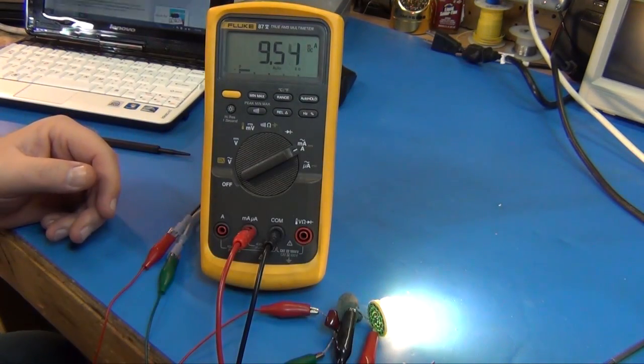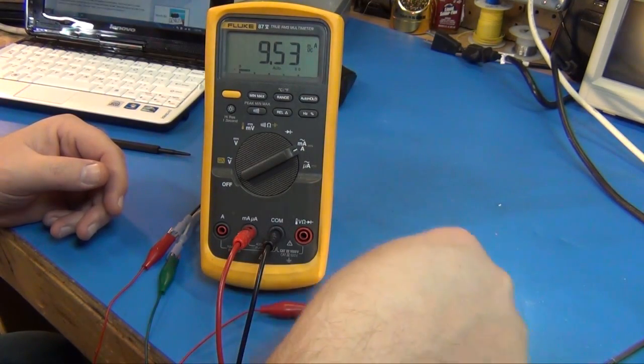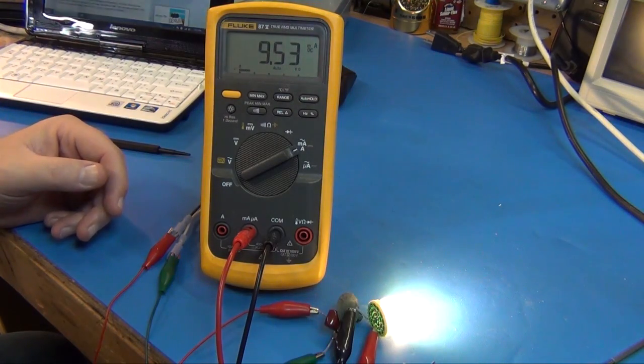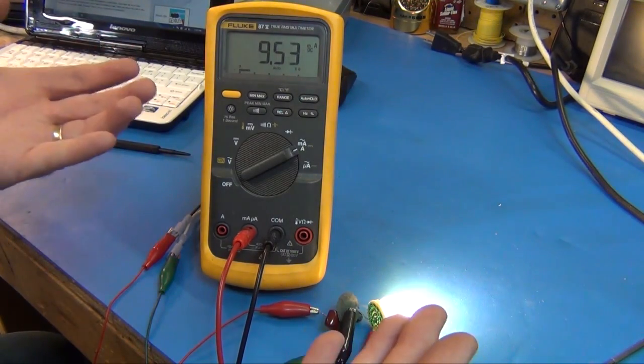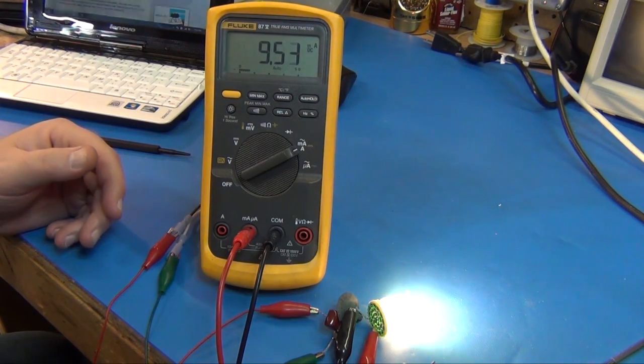I think this blows my idea of using this as a headlight for my bicycle, because I don't think I'm going to be able to easily produce the 84 volts that this probably mostly in series light bulb array needs. That would be silliness to try. There would be other ways of doing a lighting solution. I was just thinking with such low wattage, it'd be easy to produce the energy, but getting it over to a DC signal at 84 volts to drive this might be a bit much.